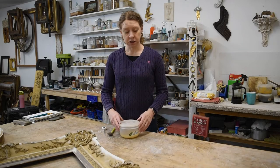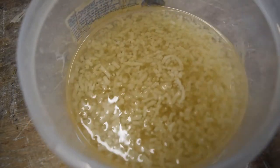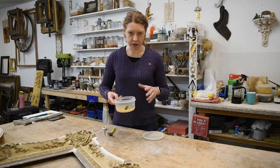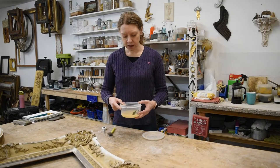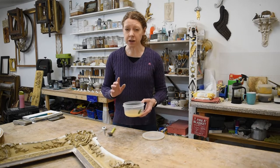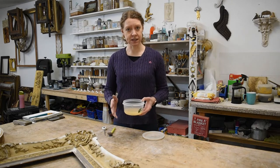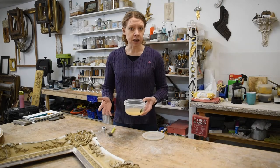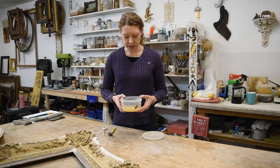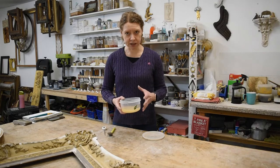The glue has had overnight to soak and the granules have all swollen up really nicely. Now, traditionally you'd put this in a bain-marie — a pot of water and then put this pot in the water — but for speed I usually use a microwave. The one thing you really have to be careful with is not to go over 60 degrees C. It'll destroy the glue if you go over that, so you might as well throw it away if you've boiled it or gone past that number. I'm just going to put this in the microwave so you can see what it looks like once it's nice and warm.